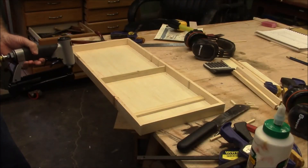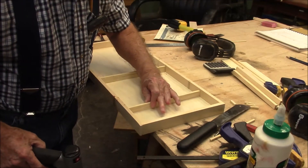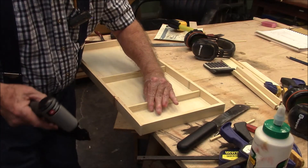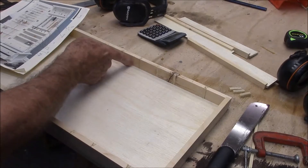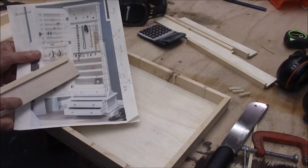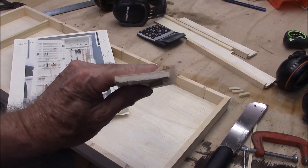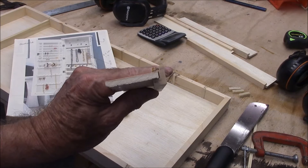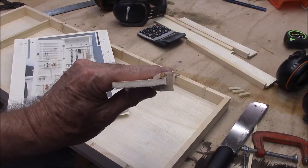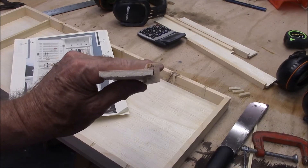I got the box narrowed down a little bit. What I'm doing now is positioning the little shelves — I'm just going to stick them in with pins. I filled in all the dados here because now we have to begin work on these four pukas. I originally modeled the pukas with a dado that went down the center of that piece of stock, but for the new pukas I'm going to put the shelf in a rabbet instead of a dado. So let's make one of them and see if it works.